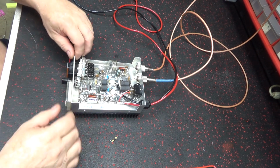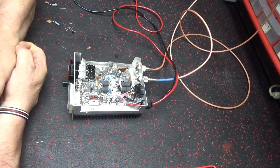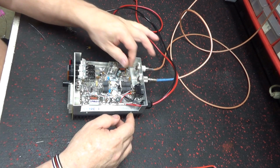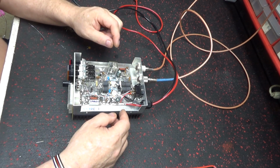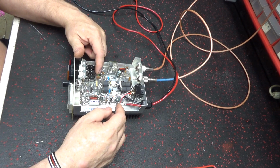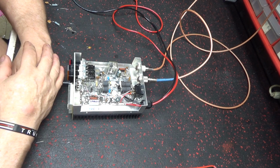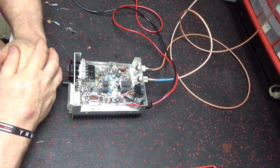It's pretty old amp, Killer B 250. But I would key it up and it would go into oscillation even though I fixed everything in it. I checked the input cap, the output cap, this cap here, this cap here. I know this, I didn't check that before I put it in there. That cap there, checked that one, and it kept oscillating. But I didn't have the input to the transformer because I didn't know what that was going to be.